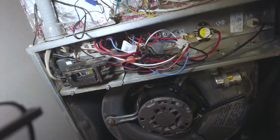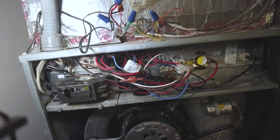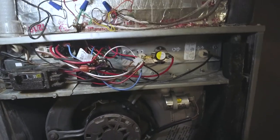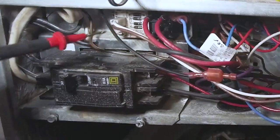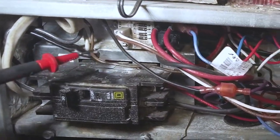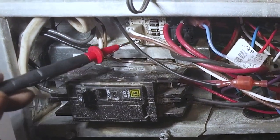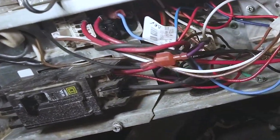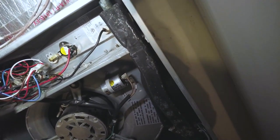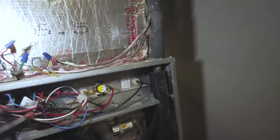Rectifier was still good. If you guys know, please leave a comment — what is that rectifier for? Why can't we just use straight 24 volts to energize this contactor? Because I checked on the back and these contacts aren't on a closed circuit with the 24 volts coming in — it actually goes to the rectifier before it makes contact with these terminals, and these are paired. This must just be for tap-off, maybe a communicating system that takes DC voltage. But I'm not sure why that contactor needs DC voltage. Definitely one I haven't seen before — we'll see you in the next one. Thanks for watching.